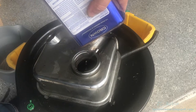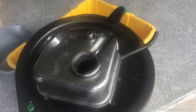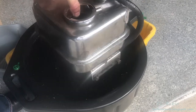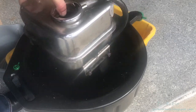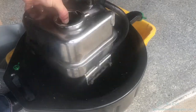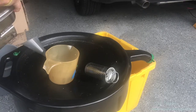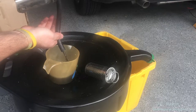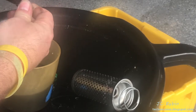Pouring some kerosene — be sure to recycle. I also connected the bottom hose to the top just so nothing would leak while splashing it around. I'm going to let this sit and get agitated a bit. I've got a cup on the container — I'm going to pull that hose off the top so I can drain into the container. First I'll drain from the nut, just to make sure that passage in the hose was clear.